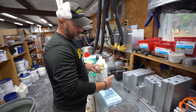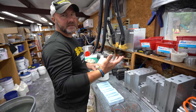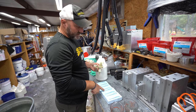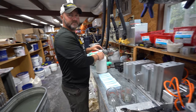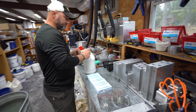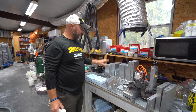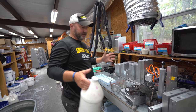If the molds are cold, it's going to make your plastic cool way quicker than you want, especially in the small areas — you're not going to get the same quality of pour. I used to do the same thing when I custom made jigs — I would run hot melted lead through the mold three or four times just to get it hot. Once the mold's hot, it's going to form the bait or jig head a lot better. If you're hand pouring into an open aluminum mold, heat them up on a hot plate or an old griddle.